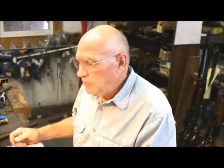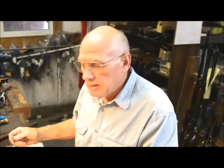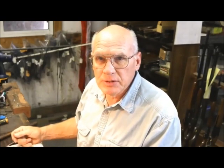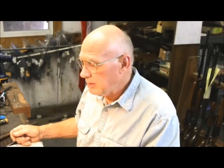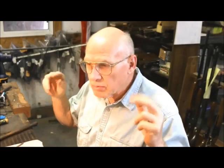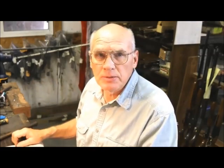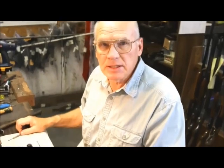All right, we're still continuing with our restoration on the 1911 .45 and our Browning High Power. We have since broken these guns down and polished them. We've replaced lost lettering and proof marks. We straightened up a lot of buffed edges that were rounded and radiused and funneled-out holes. We repaired all that from this previous so-called restoration. Bad blue job. You see them like that all the time. So we're in the process of trying to salvage these two guns. I think we've done it.